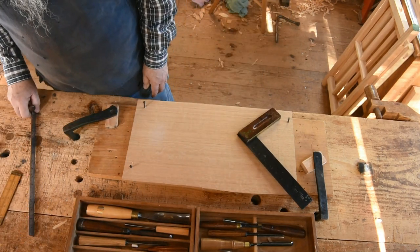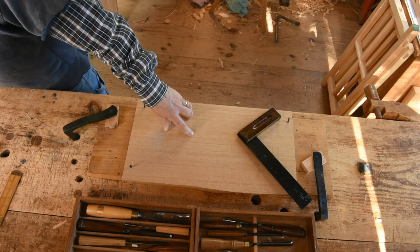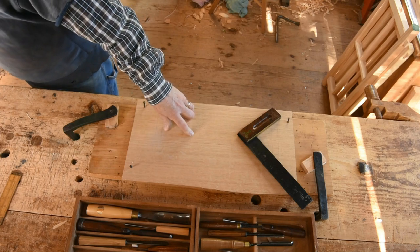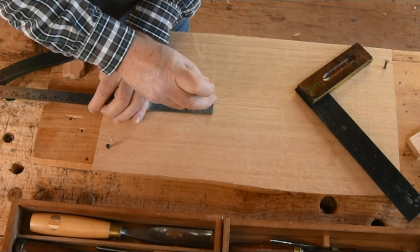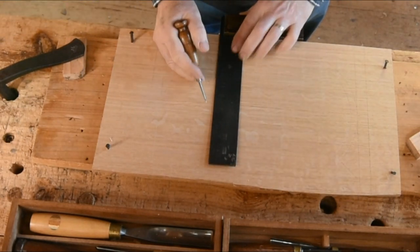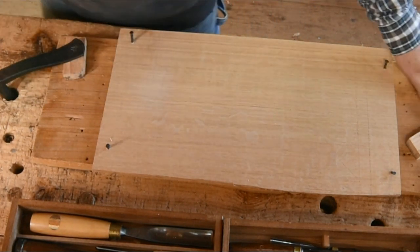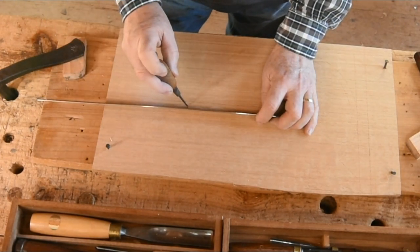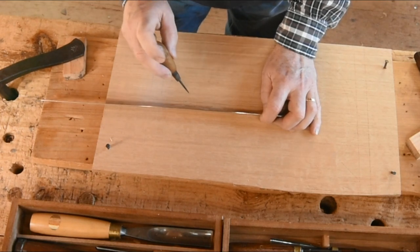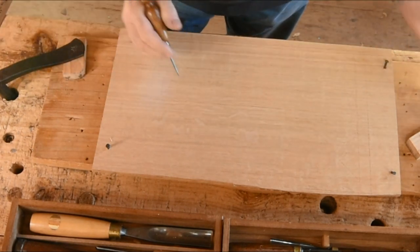And then I will set up the horizontal lines for that urn. And that piece is about 2 inches high, and it's about 1¾ inches off the margin. And those can vary. You can mix that up however you like. As you do more of these panels, you'll experiment with this shape here. But for right now, I'm just striking the top and bottom of that, and say a quarter inch. I'm checking the plans as I go. And I'll also strike a center line. You can't see that when I have that ruler like that. I'll strike a horizontal center line through this urn as well.